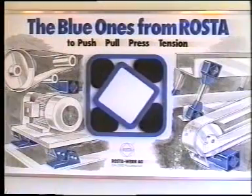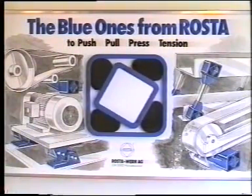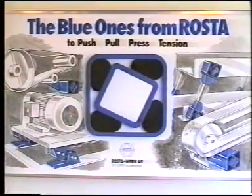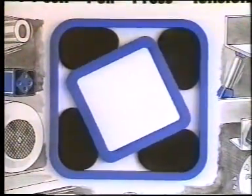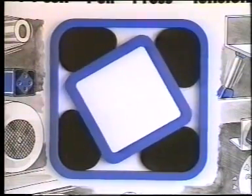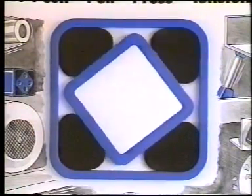ROSTA rubber suspension system is a torsion elastic spring device based on 4 pretensioned rubber inserts between 2 steel profiles. The vibration joint suspension is designed for pivot motions of max plus minus 30 degrees. The ROSTA spring device combines the functions of a torsional spring, a guide bearing, and a shock absorber.